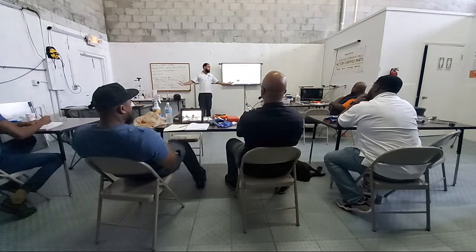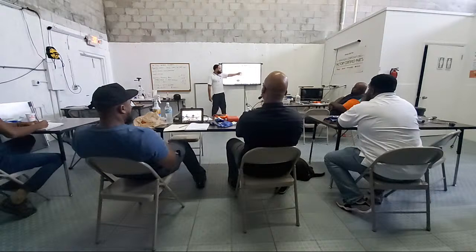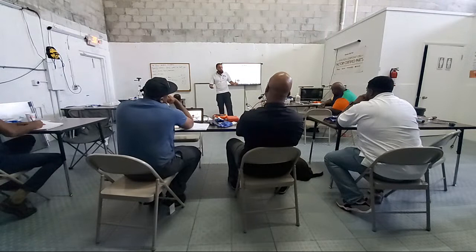I'm teaching y'all the nuances of it. You'll hear stuff like "split the system." I'm teaching you that. That's the easiest way. And you'll feel a lot of both. Obviously, coming out of the drier, you'll feel greater pressure. It's a greater diameter, as opposed to your capillary, which is a thin, small tube. You're going to have a different pressure come out of it. But at all costs, you should have pressure coming out of both. And if you don't, I've shown you as well how you can isolate the system and perform other tests.